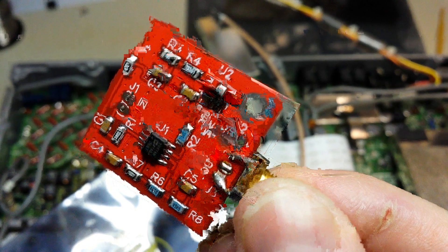I'll go ahead and solder it to this side first. We're going to take one end, solder it into the input of the buffer amp, and the other end is going to go to the filter. I'll explain more as I go along. I'm going to go ahead and prep all the soldering.